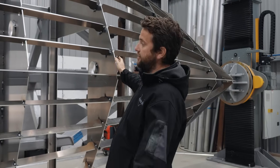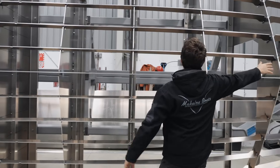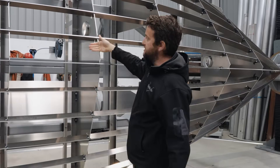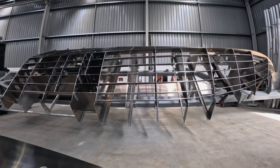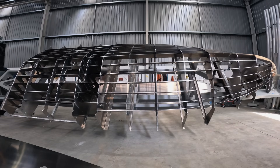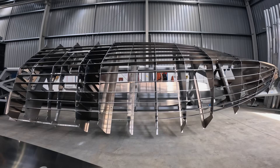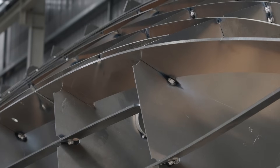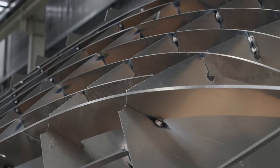You can imagine if this boat here only had these two frames here and not as much hull structure, it'd be very easy for it to collapse between frames. That's why we build the hulls this way. We see a lot of boats out there in the industry that don't have sufficient structure and they collapse between frames. We've seen the whole front end of boats stove in when they're pushed hard in offshore conditions, which they're not designed to do.